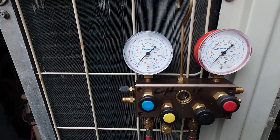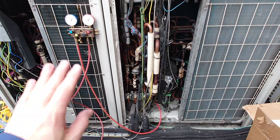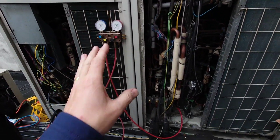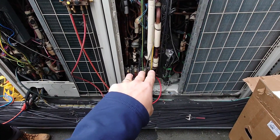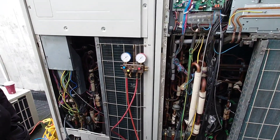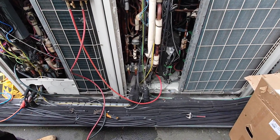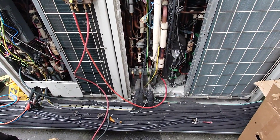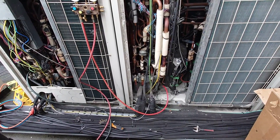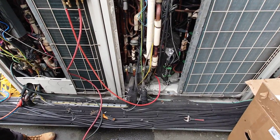We're almost down to zero, just sucking vapor now. What we tend to do in a situation like this is once it gets down to zero, pump down your reclaim unit, shut all the gauges off, but leave your gauge attached and just watch it — because these valves, although it's a fairly new condenser, can let by even when done up fairly tight. Watch the gauge pressure to see if there's any gas getting back in — you'll see it fairly straight away. Don't break into the system if you've got leaky valves. If the pressure is rising, that's when you need to think about reclaiming the whole system. Don't break into the system until you're 100% sure the gauges aren't rising because the service ports are letting by.